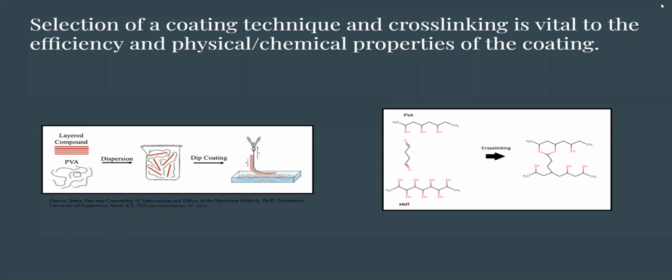Several types of coating processes were available to the team, including dip, spray, and rotational. For the experiments, the team used dip coating, as it is most efficient for the relatively small and uniformly shaped substrate samples we applied the coating to. However, in large-scale operations, spray or rotational coating may be more viable in order to coat large packaging or pre-made packaging that is not uniformly shaped.